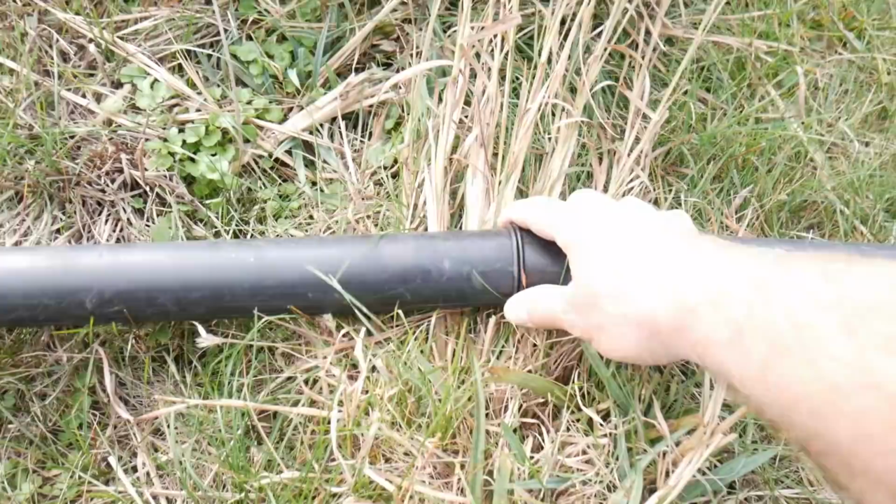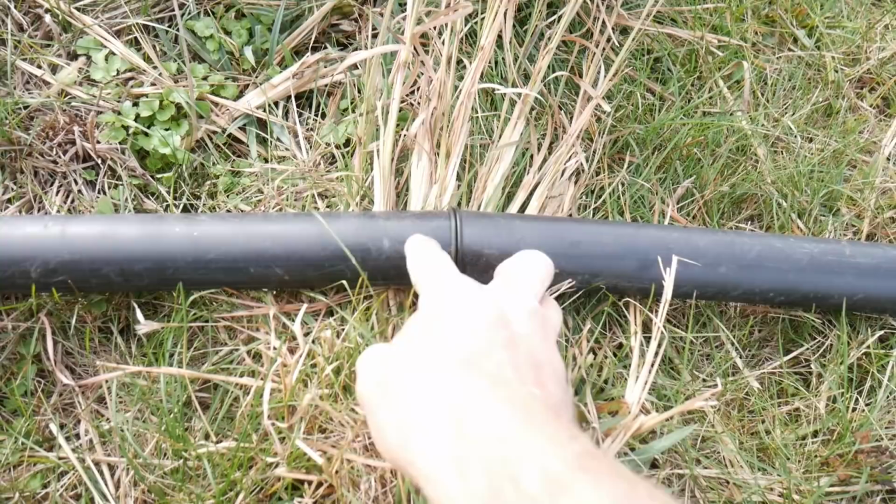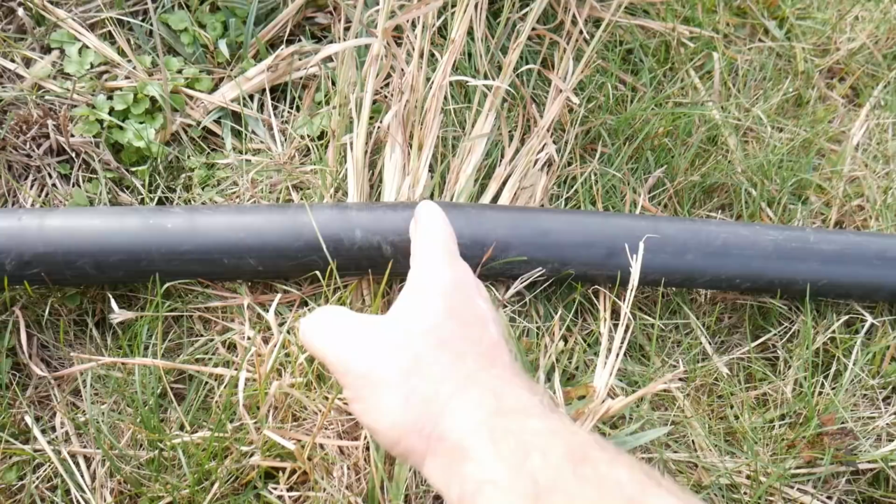All right, so if you're ever wondering what a plastic weld looks like, that right there is it. All it is, is two joints of pipe. They put a special iron in between each piece. They bring them together and kind of melt each end. Once that's hot enough to the right temperature, they pull the iron out